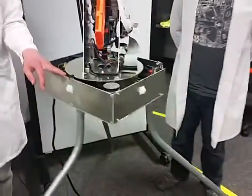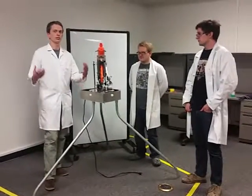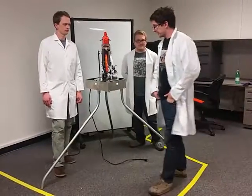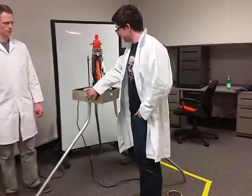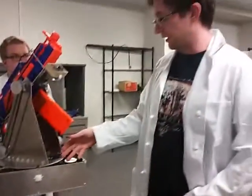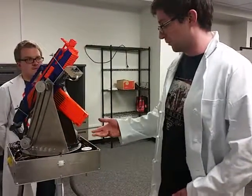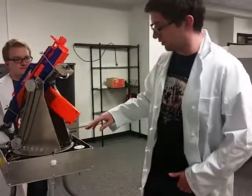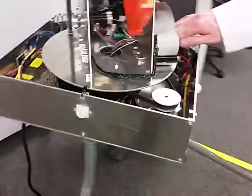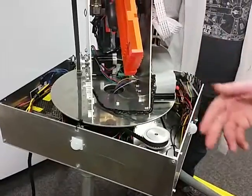And what those do is they trigger the ARM core processor within this device to wake up the system. And that'll initially rotate the device to where it wants to point. Right. As you said, the PIR sensors wake up an STM32. It's an STM32F0 Discovery. It's a 32-bit ARM core processor, and it does all the control of the DC motor, and then the DC motor controls the horizontal rotation of the Ark.